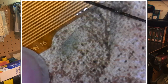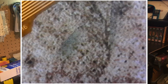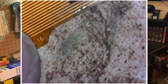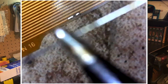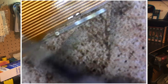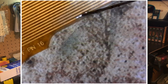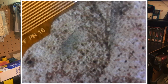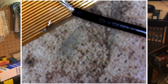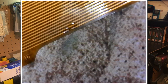Let's add a little flux — this is MG Chemicals liquid rosin flux. My dispenser needle tip is jammed; when that happens I usually just clear it up with a little heat. And it should be flowing now — there it goes, only on one side, so I'll have to spread it with my jumper wire. I guess now my jumper wire is double-fluxed since I've got the gel flux and this liquid flux on it.